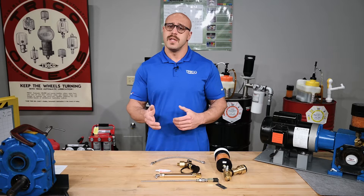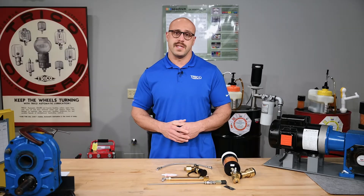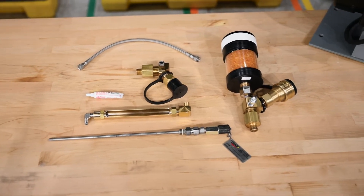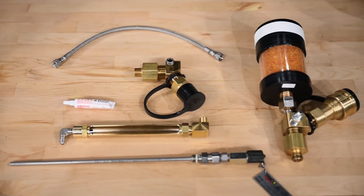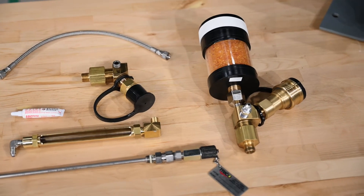Now that we've checked out the features, let's take a look at how we'd install this kit on your gearbox out in the field. One last thing to note: all fittings and components come preassembled and packed hand tight without any hydraulic sealant applied to the connections. This is done intentionally because each application has different clearances for rotation when threading them into the equipment. Ultimately, it's up to the on-site personnel to determine how much preassembly is done in the shop, as well as in the field, where hydraulic sealant should be applied to each connection point on the gearbox kit.